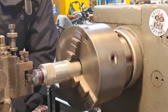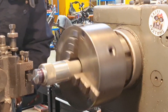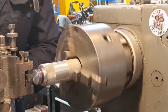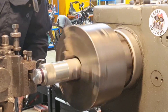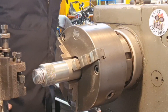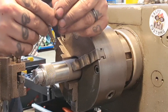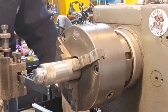Just a little cut, pick a line — any line — cut on, and then have it off. That should be 1.5 pitch. If I knew where my thread gauge was — there's this one. So we're looking for 1.5 on the metric scale, which is doing 1.5, and that is — oh, straight end, that's lovely. 1.5 — so we'll just do a couple more passes. A bit of lube on. The tool's coming real close to this edge so we're going to have to watch that. Okay, last pass — little spring pass, wait for a line to come. Here we go, pause at the end.